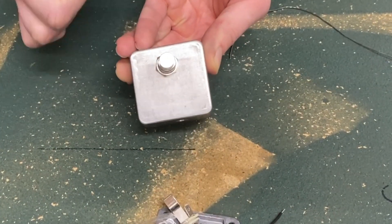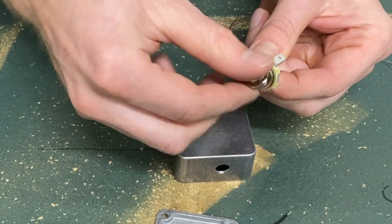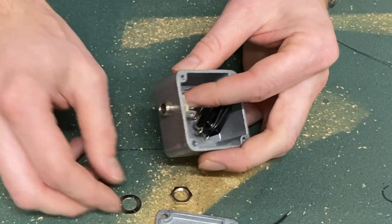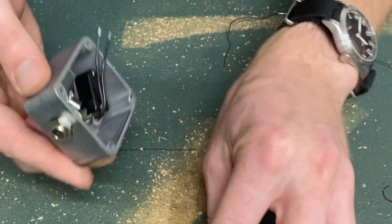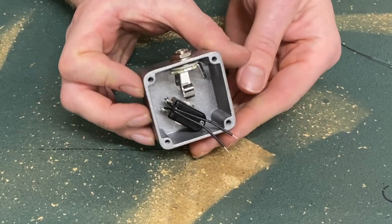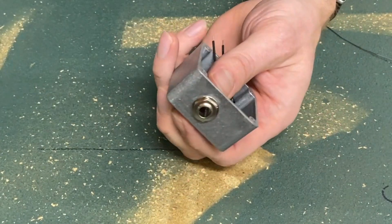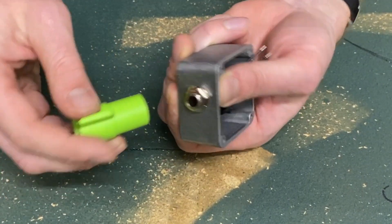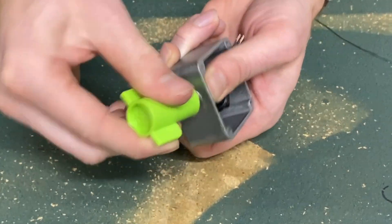If you've soldered these wires from the outside of the enclosure, move the switch to the inside. Now take your quarter-inch jack and remove the hardware. Insert the jack into the smaller hole, put the flat washer in place, and install the nut finger tight. Adjust the placement of both the switch and the jack so that they have clearance away from each other, the lugs are easily accessible, and the solder lugs aren't touching the enclosure wall. Once they're in a good position, tighten them down with the Rocket Sockets — the switch uses a 14mm socket and the jack uses a half-inch socket.